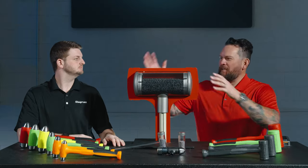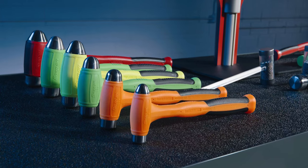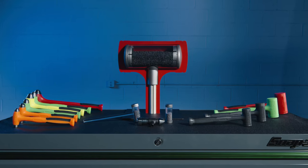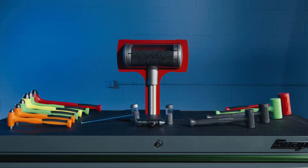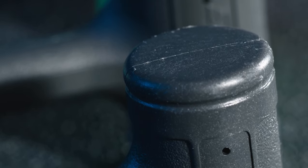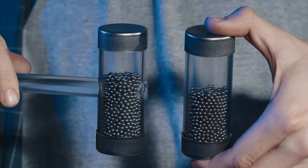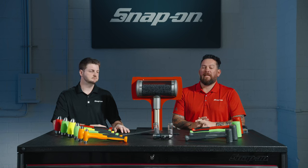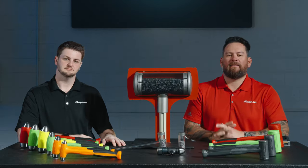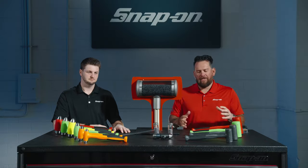We're going to talk about hammers — the hammer in the room right here, this big cutaway. A dead blow absorbs rebound or recoil when the hammer strikes. It is an extremely useful tool as it minimizes damage to the struck surface, and its minimal rebound helps to avoid accidental damage to precision work, especially when working in tight areas. The reaction force is countered as the shot descends to fill the face end of the head. The blow is less sharp than a conventional hammer and feels more dead — less elastic rebound — hence the name.